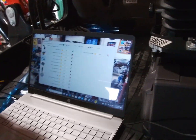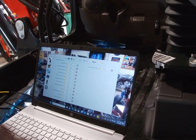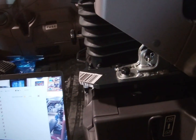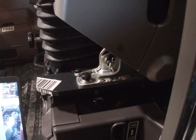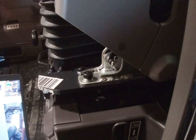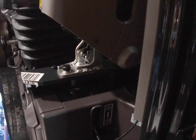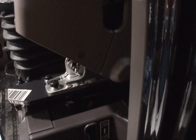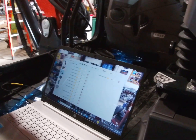It's important. Here's your setup page. You only got two things to do, and you don't need shear to operate, but you need it if they ever take the tilt rotator off. If shear's not enabled, they won't be able to hold that button. You need to get rid of that button that keeps on. Switch to shear button. There you go. That way, with the tilt rotator off, they can put the thumb, the grapple, on. A lot of them all have grapple. And that way, take the tilt rotator off with the grapple on, they can go underneath the water.